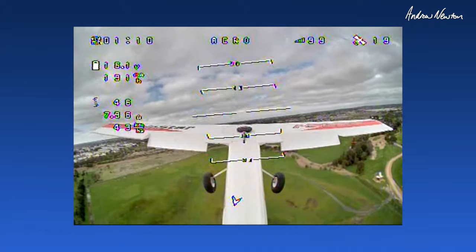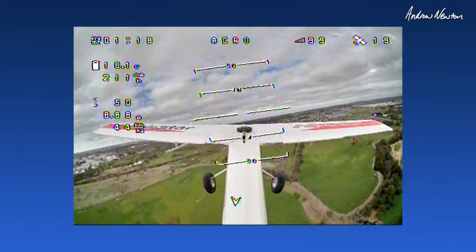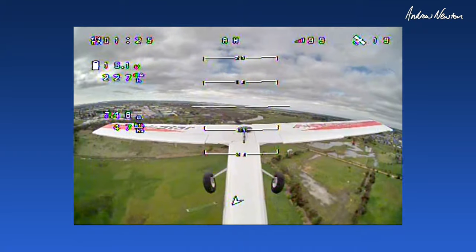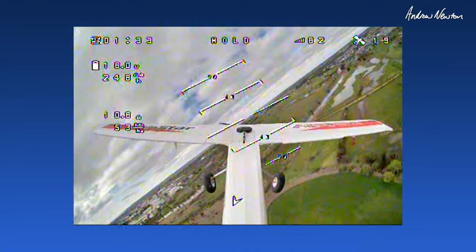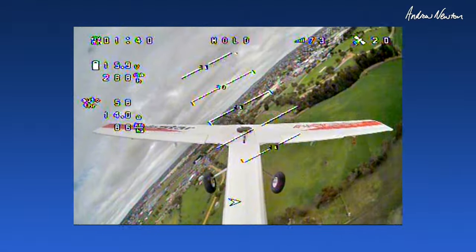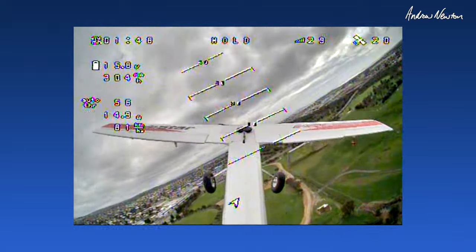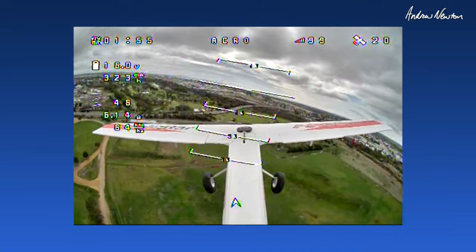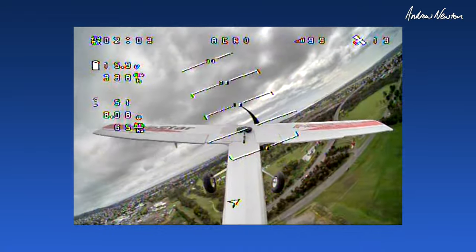The stack of PWM outputs allows you to do just about whatever you want with this board. Trying altitude hold — going very well. Loiter mode — loitering nicely, not overreacting, because I don't have yaw stabilisation on. I've decided INAV doesn't handle that very well; it overreacts. So I have just a yaw on the yaw channel, and all my nav mode turns are nice and smooth now.